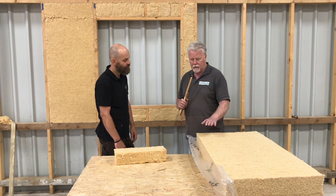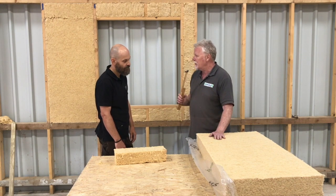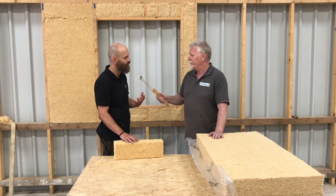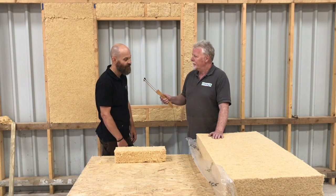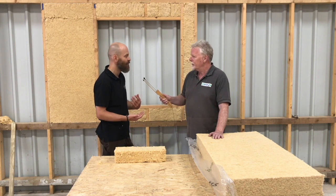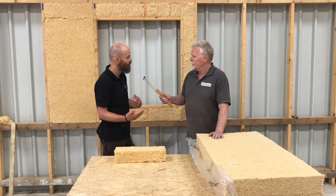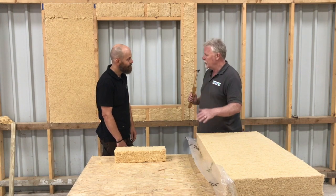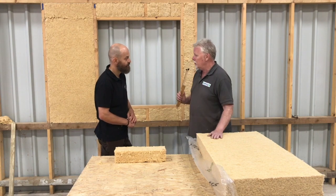Some of the other features of this product is it's quite dense. Perhaps you could just talk us through the implications of the density and how this is actually used and what it might do. Typically, because it has the same lambda values, the same thermal conductivity, same U-value, but it's about two and a half times as dense as mineral wool or glass wool, that means it's much better at summer heat protection. So a wood fibre insulation will work all year round — it will keep you warm in the winter, but it will also keep a building much cooler during the summer months. And this is because the density helps prevent the heat being transferred through the building envelope, as it absorbs the heat and resists its passage through the actual building structure.